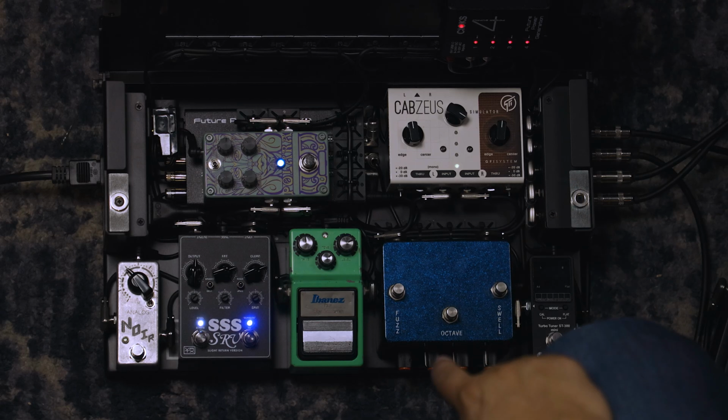So it makes the routing of the cabling for power really simple, because I can literally put it into any single one of these power outputs, and I don't have to worry about whether it's going to meet the voltage requirements or not. Secondarily, it also allows you to see on a meter on the actual display, and I've got it covered with my Polera, how much of the current capacity you've used up, and no other power supply does that.